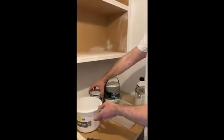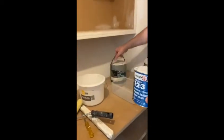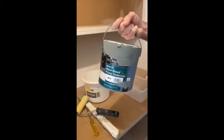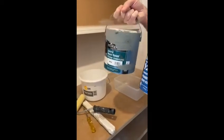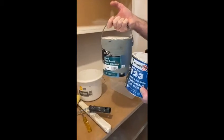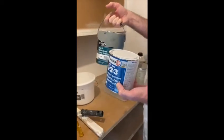Primer. So I've managed to find this product in the shed but there's not quite enough of that to do all these shelves. So I've also found this — another primer that we'd obviously tinted down. We dropped some pigment into it, you can tell by this grey colour, because we would have been priming something going super dark. We're not going super dark here, but what I'm actually going to do is mix these two together to make a lighter primer and make sure I've got enough to use.